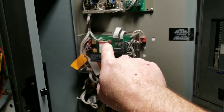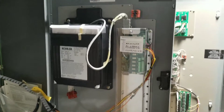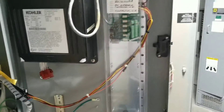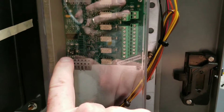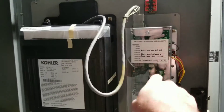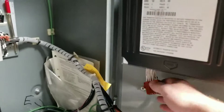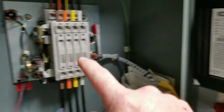You're going to take out the M340 controller and basically clear the whole door — everything off the door. You're going to mount a plate to it. Mount the I/O board and the controller. If you need to run two I/O boards, make sure you change the DIP switches to the right polarity. Make sure you have the harness going from the I/O boards to the controller and plugged in on top.